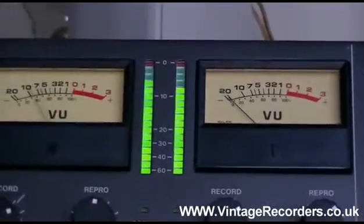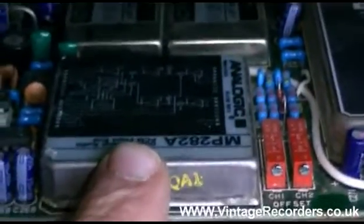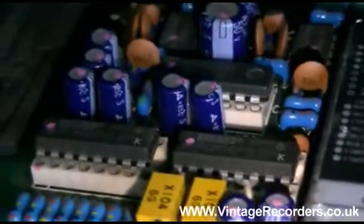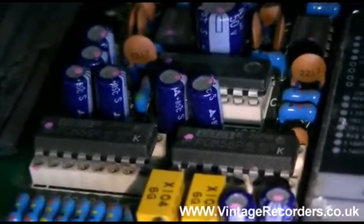But sometimes you tackle a machine as complicated as this with too much thought. I traced a signal out of it — which was the two stereo superimposed multiplex signals — to an actual digital-to-analog converter in the back. Down at the very back is the beginning of the audio op amp stage. Then I noticed at the very beginning, two ICs — PCM56Ps. I thought, well, there's two of those and one channel is dead — what the hell, swap them over. And sure enough, the right-hand channel is now dead. Problem solved by just swapping a chip.